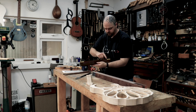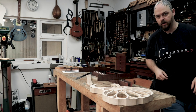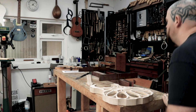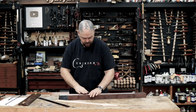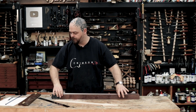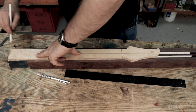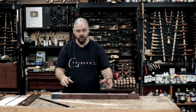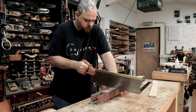Now the trick with winding sticks: you've got one that's got those on it, and one that's just normal. Then as you sight down from one end, you'll see if there's any twist. There's a tiny, tiny bit of twist — maybe. It's infinitesimal. There's a very, very small twist in there. It's entirely possible I put it in during the planing process even. Now we have a roughly rectangular blank. I'm going to measure from the center, so I need to draw a center line. And because I've got so much excess, I'm just going to plane the edge to a point where I have a perfectly rectangular blank. I will use that edge to run the fence of the router and do the truss rod. Once I've cut the neck blank to length, I'll see if I can see any twist or not, and plane it flat accordingly.